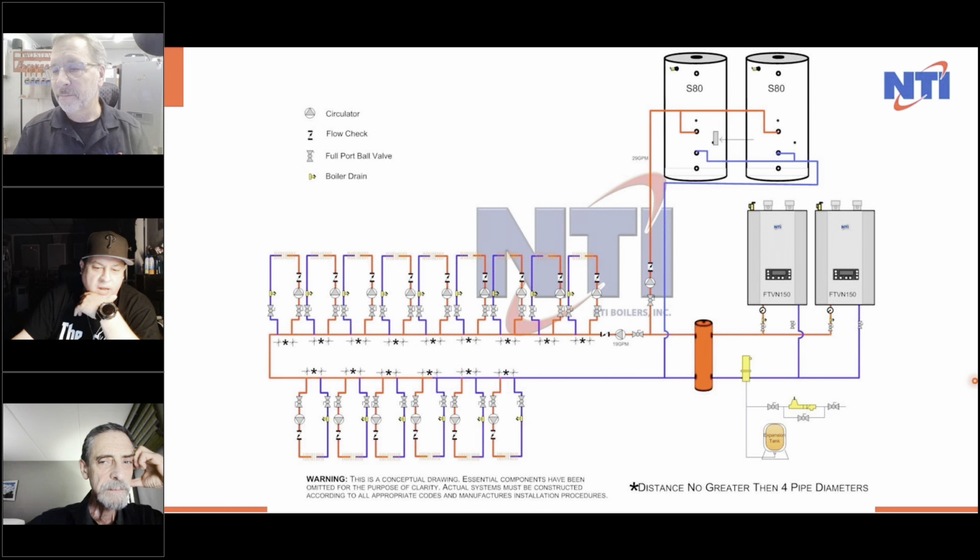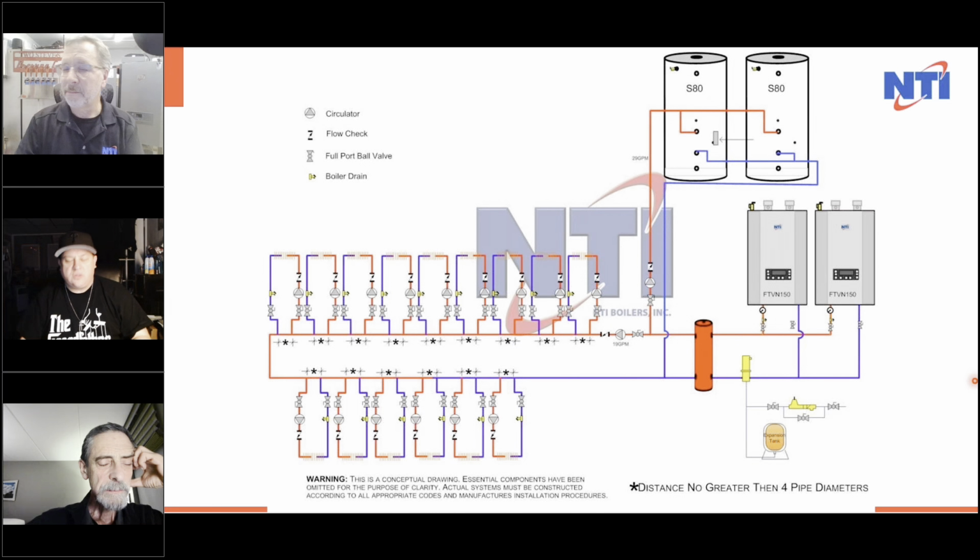And listen, guys, you got to learn how to test. You can't go in and say, hey, that's four sections. You got to break out the ruler, measure it out, go doors and windows, measure everything out. Do it right. Because I'm telling you, at the end of the day, if you don't, it's not going to work right. You got to test. Even when you go to a service call, test. Break your analyzer out. Break your meter out. That's what they're there for. Not there to sit in your bag.